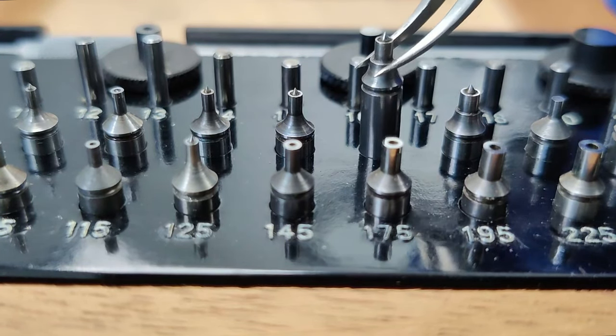And let's oil the upper and lower cap jewels with this automatic oiler. Okay, kudos to you if you noticed the funky center jewel during our disassembly. It looks like someone replaced it with a brass bushing, and honestly, I'm pretty impressed. I mean, I wouldn't be able to fabricate this, that's for sure, which is why I just borrowed a new jewel from the donor movement.